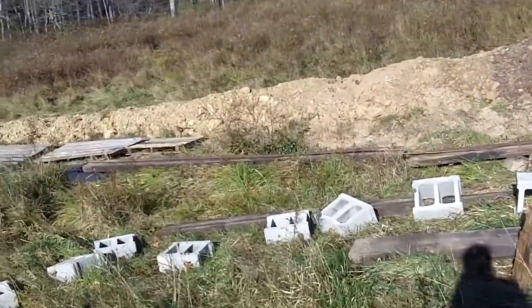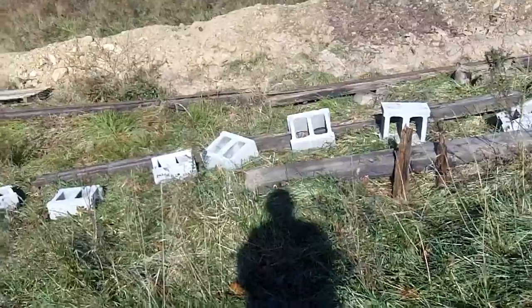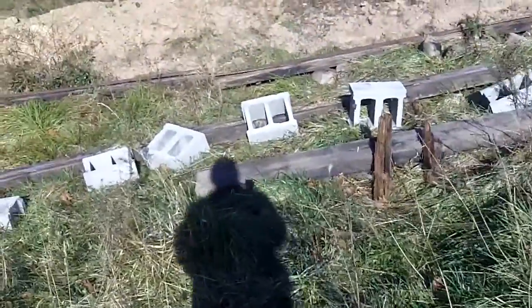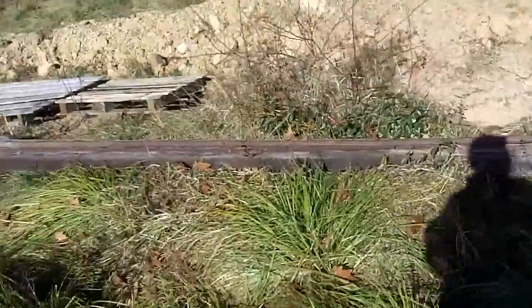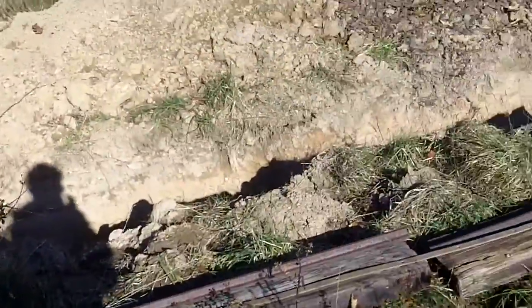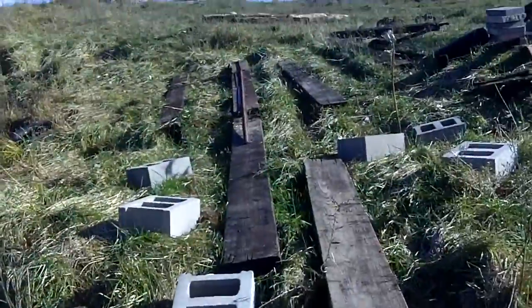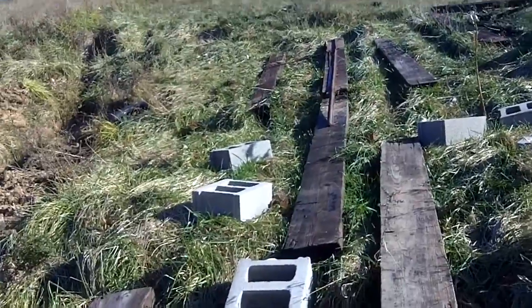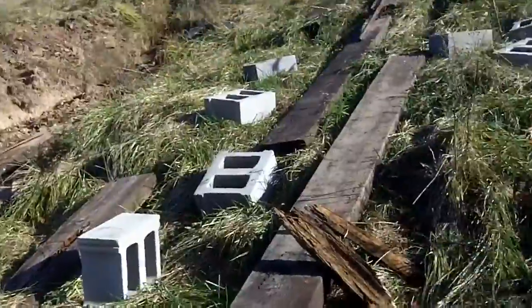Once I know the length of the building, I plan to start laying it off here centered — I'll lay it off from the center outward. The building is not going to be as long as the sawmill itself. I haven't actually measured the sawmill just yet, but I know how long the track is because I've laid the track out. I have to put that track together with that track — it's quite long, and so it'll extend out from both sides. These 14-inch blocks, I got them for a dollar a piece — they were seconds, nobody wanted 14-inch blocks — and I'll set the timbers on top of that.